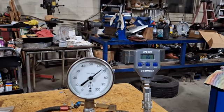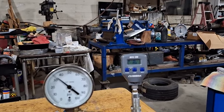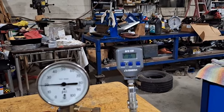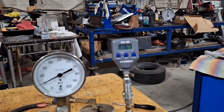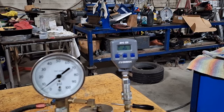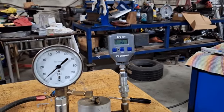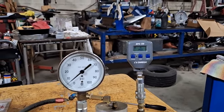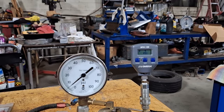That's basically how you use this thing. You can take the gauge out of your airplane, or you can leave the gauges in your airplane and use a calibrated gauge. This was used on PT6 torque transmitters — I can't remember exactly how often they needed calibration, but we used to calibrate the torque gauge when they did hot section inspections, or even when the engine got replaced. You had to check and make sure the torque sensor was accurate. You had a calibrated gauge connected to the unit, then hooked it up to the transmitter on the airplane to make sure it was transmitting correctly to the analog gauge.